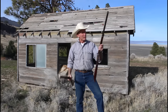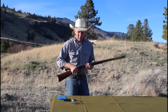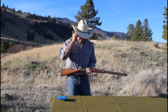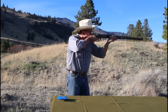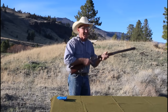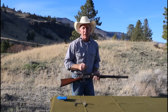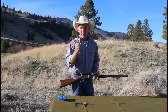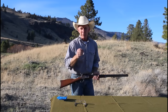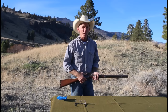We'll get a little shooting in with this .25-20 and see if we can't ring a few bells. That's the sound we were after. The firing pin that came out of it was not only .025 inches too short, but it was in really rough shape — it had been welded on, there was porosity in the weld, and it wasn't even ground straight. So it was cheaper and easier just to replace it with a mail order piece that was only 25 bucks.